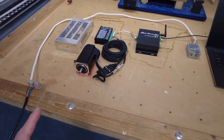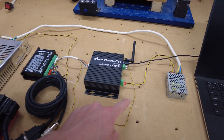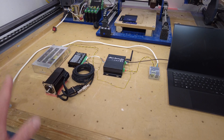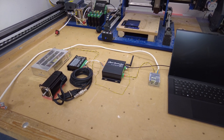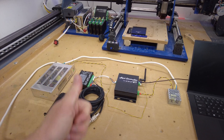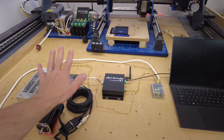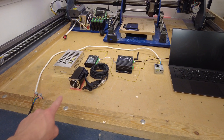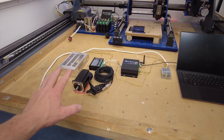If it doesn't move accordingly, it will trip this wire and signal to the controller: 'Hey, stop — I've missed a step or the motor hasn't done what I expected.' FluidNC is clever enough to have a fault pin that we can use to halt the program and stop any progression. These things are neat — I wish I'd come across them sooner, but they're brilliant.